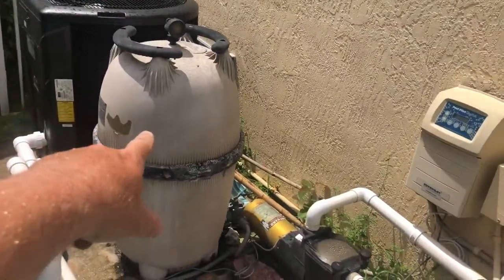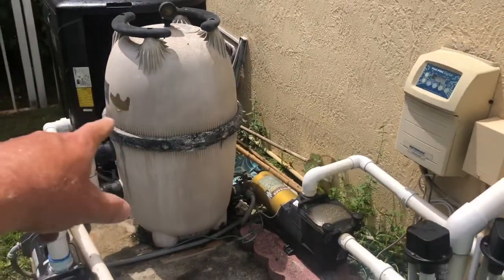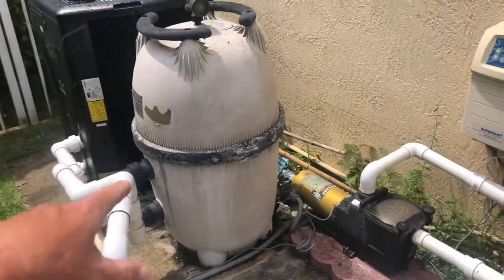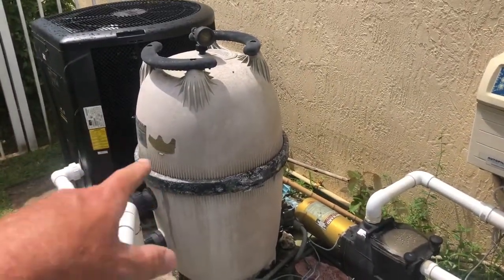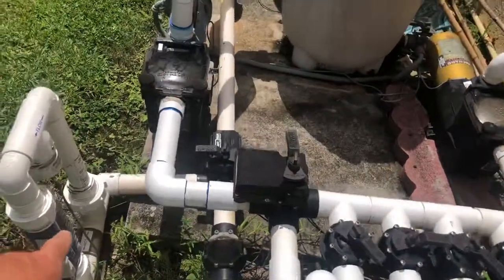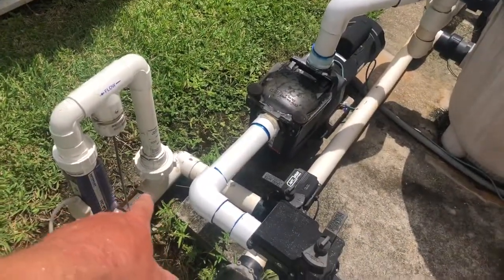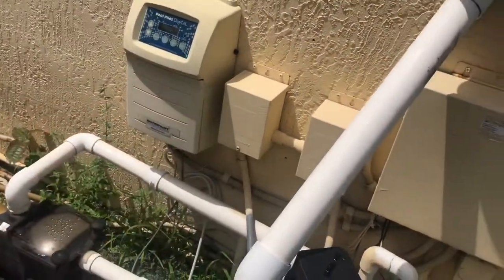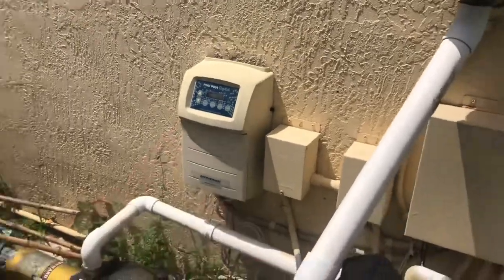Check that screen periodically. A lot of times you're going to get debris, especially with a quad filter — you get a lot of grass and tree trimmings, fine debris, lint, and hair. That's why they designed this manifold to have a screen in place. So clean that screen periodically if you're getting a 'check system' or 'no flow' light turning on.